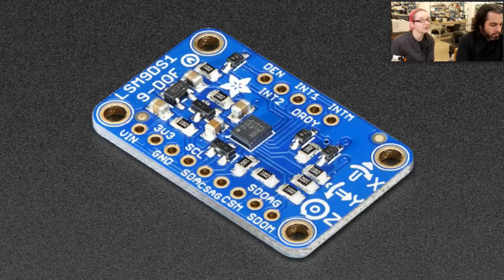It actually is three sensors in one. You get an accelerometer, a magnetometer, and a gyroscope, all in one, 3 degrees each. So it's three sensors, 3 degrees each, 9 degrees total. XYZ of acceleration, magnetic field, compass, whatever, and then gyroscope for twist.